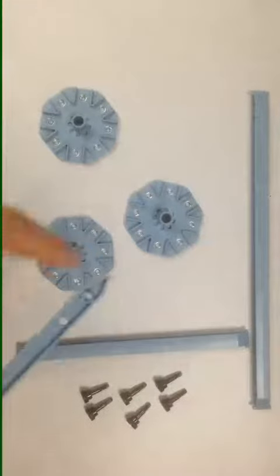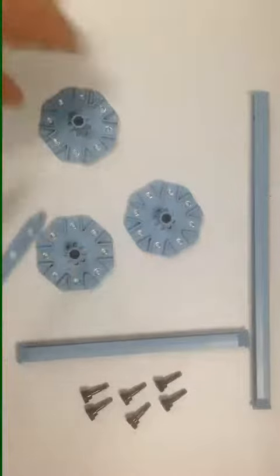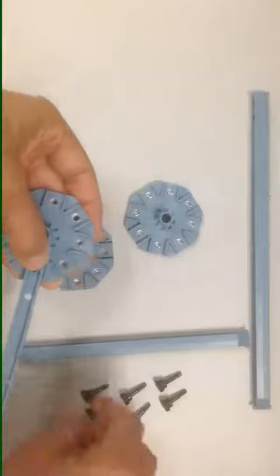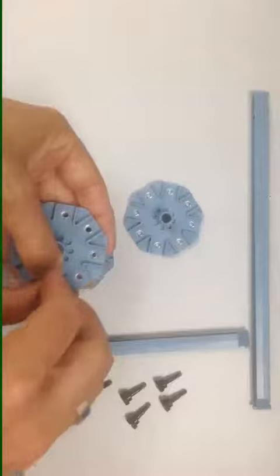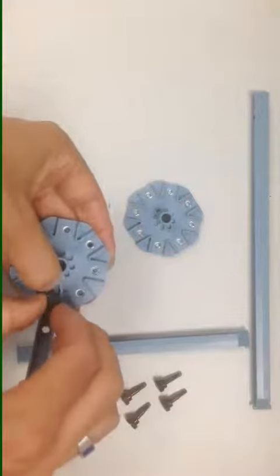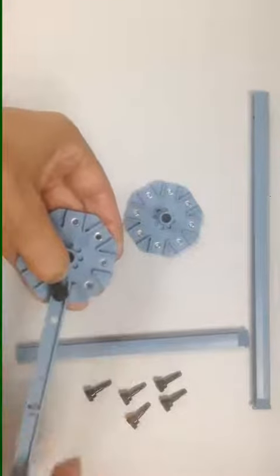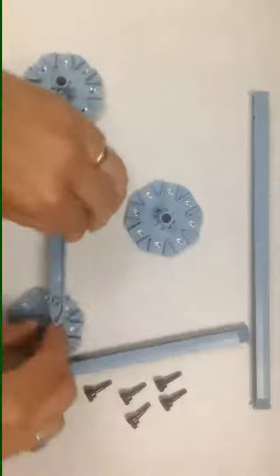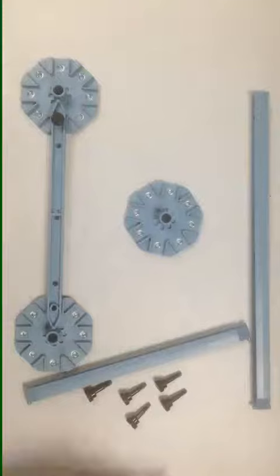Start off with the number 4 member, attaching the pin to the recess within the center part of the connector, and then affix that with the screw. Tighten it all the way down finger tight, and then back it out one quarter turn so that the joint does not support any moments and will only be strictly compressive or tensile.